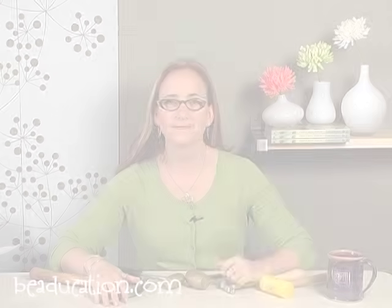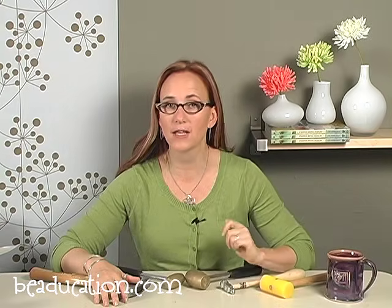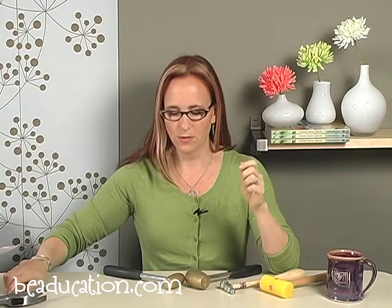All right, so now you need a hammer to strike your stamps with. Make sure that your hammer is at least 1 pound in weight, which is 16 ounces, because you're going to need that weight behind the blow to get a deep impression. Those light hammers, like them girly hammers with the flower handles or the pink handles, we need a heavier hammer than that. So for years I just used a basic old nail pounding hammer, just a household hammer here, and it worked just fine. So that is an option, just cheap from your local hardware store.